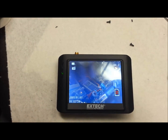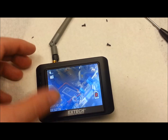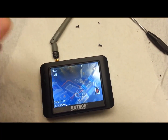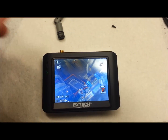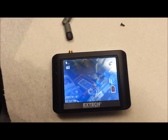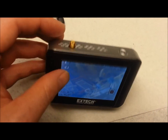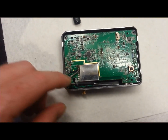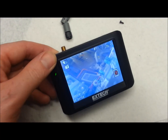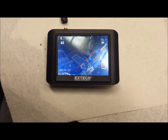Here we are hooked up to the wireless through the borescope. I just walked around the house and mounted the antenna — the difference is actually quite remarkable. I took it to the point where the signal was fading out, tapped on the antenna, it came back full strength, and I could go back another 30-40 feet in the house. That's with no change in transmit power — only changing the receive antenna. Even with unshielded wire sistered with an existing antenna, the difference is huge — many many feet, way beyond line of sight.